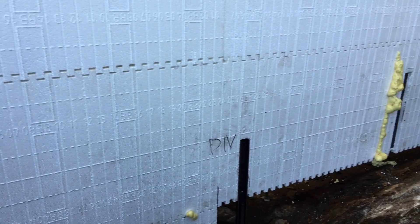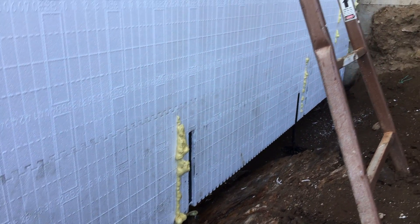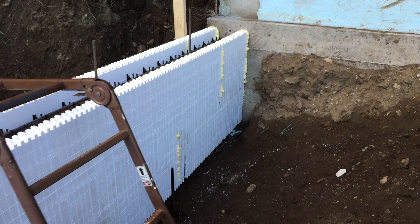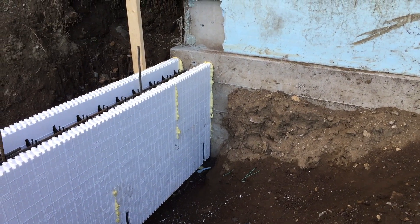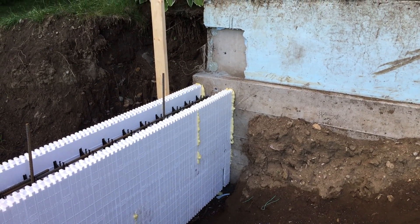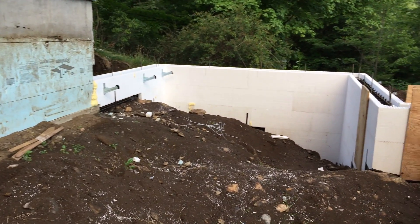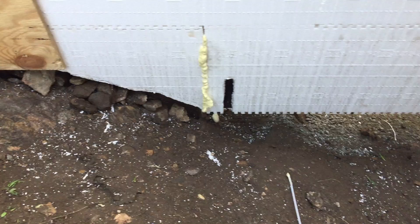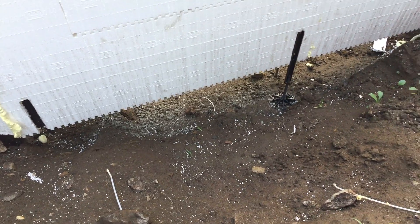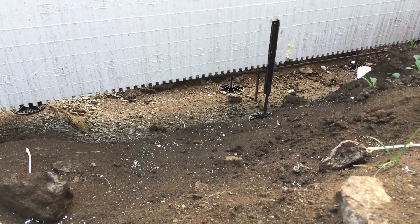After placing this first block, you go to the next block, work up a block, keep going horizontally, then I brought my horizontal course back to the wall and worked to level everything, plumb everything, and make sure it's square with the current house. Then I basically worked my way around to the other side of the house. That gap underneath — there is rebar under there, you just can't quite see it.